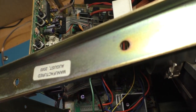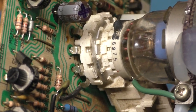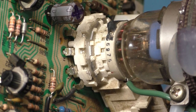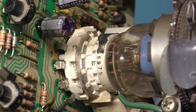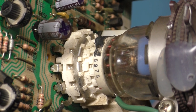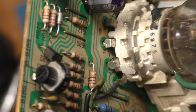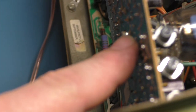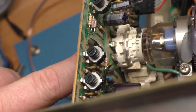And the pin that's missing is, according to this, the heater pin, but if you look here, it's marked as 7. And 7 corresponds to nothing. I'm sorry, it's 9. 5, 7, 9. 9 is the pin in the position that's missing, just the way it's marked. It's not pin 9, it's the heater pin. But in that position, according to the 5, 7, 9, 6 there, it's 9. And 9 corresponds to pin 10 right there. So we need to go to that same pin on the back, which should be this one right here. That should be pin 10. Yes, it is. So we'll solder our wire onto there.